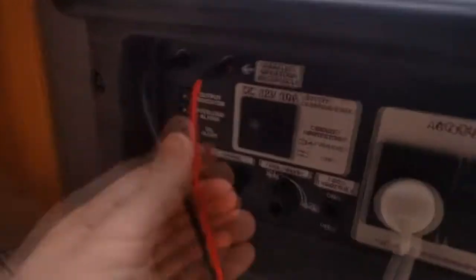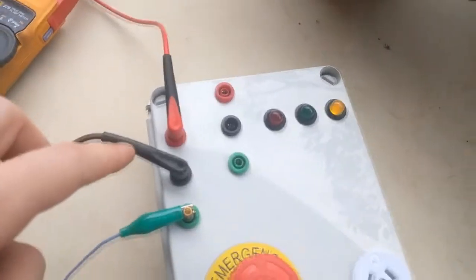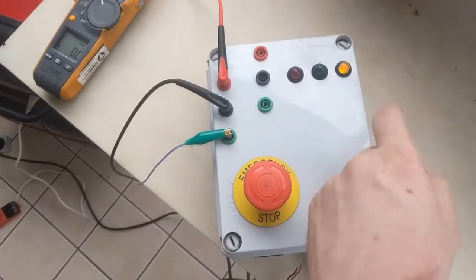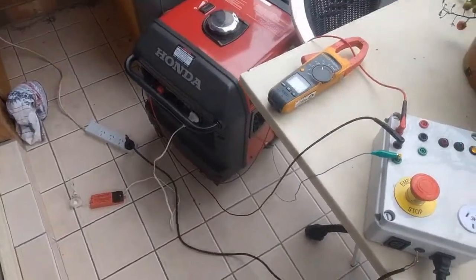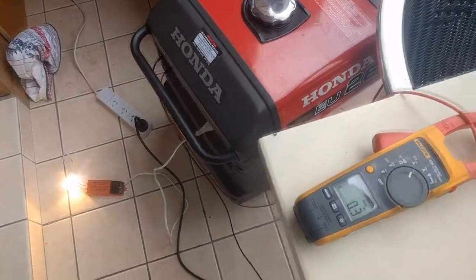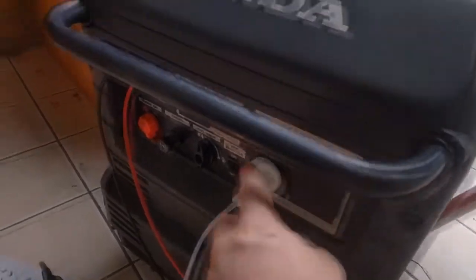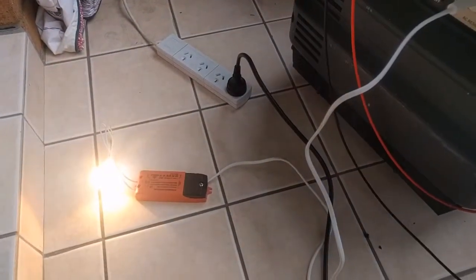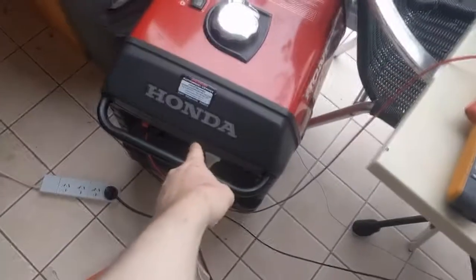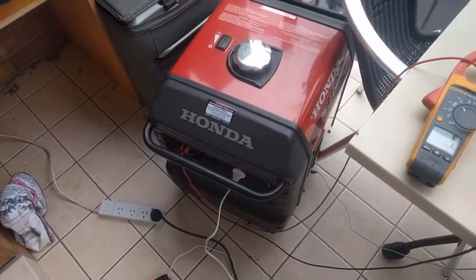It's generating output on the inverter. I've got parallel connections plus grounding coming up to the output of my safety controller. We can input this way — grid is waiting on this side. If I close the grid to the inverter, the inverter doesn't care, and you can see those sockets are now connected to the grid via the parallel connection.